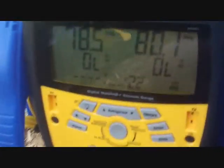I'm going to depress the contactor to get it running in cool mode, make sure it's set to cool but not calling for cool. And I'm going to use the handle off my wire strippers, since it's non-conductive, to press it in.